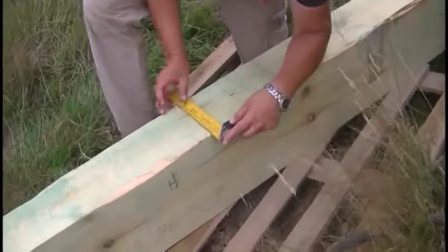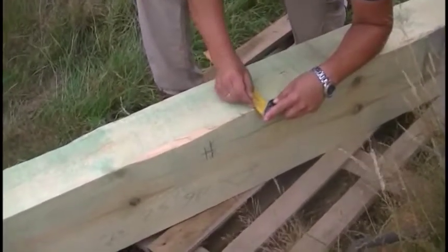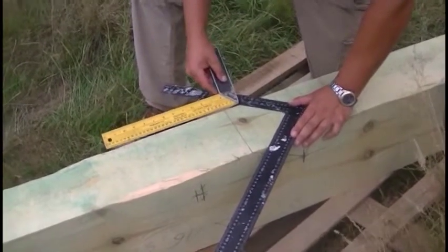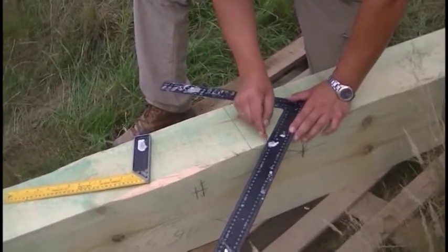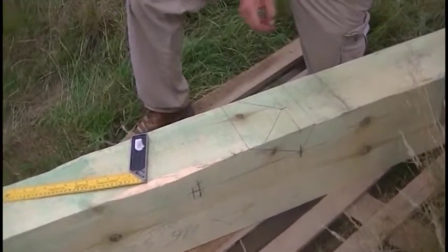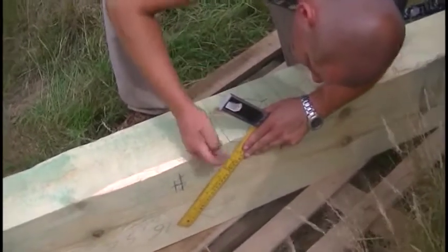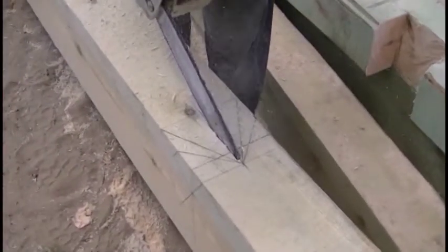We can see how rafters would be applied to the wall plates — it will be at an angle of 90 degrees. At the bottom in the circle we can see the point at which the wall plate will resist, at the corner. The socket will be cut with two angles: the first is 27 degrees and the second is 63 degrees. In a moment we will cut the lock, which explains the matter a little.